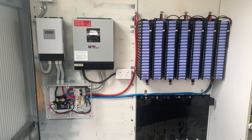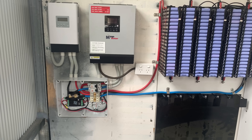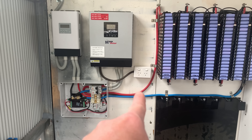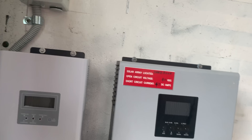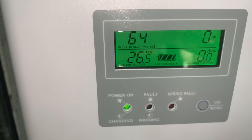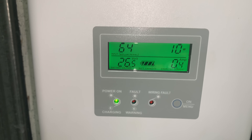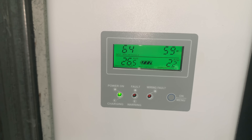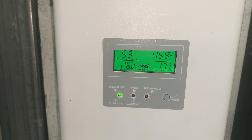I think this lot of wiring is done. Now it's time to turn it all on and see if it works. First of all, we'll have to turn on the solar up here. Now we do not have a shunt trip in here yet — I do have one coming for it — and that'll be controlled by the Watchmon. I'll turn that back on again. That kicks straight in. We've got 26.5 volts there. There is not much sun — there's pretty good cloud cover — but the batteries are charging again. It's now ramping up. It should go up to 20, 25, 30 amps something like that.